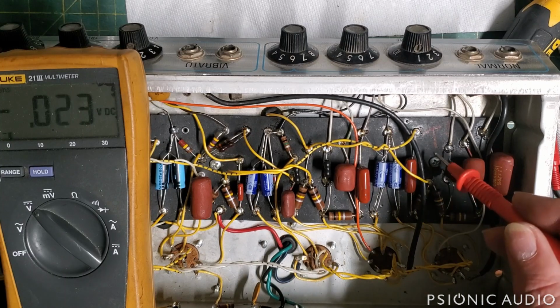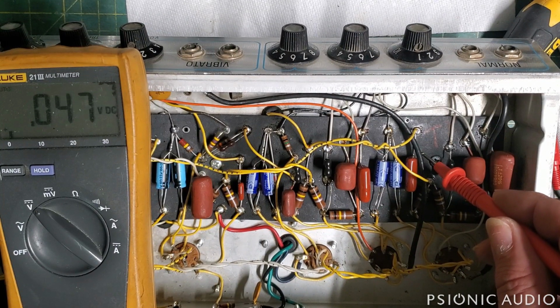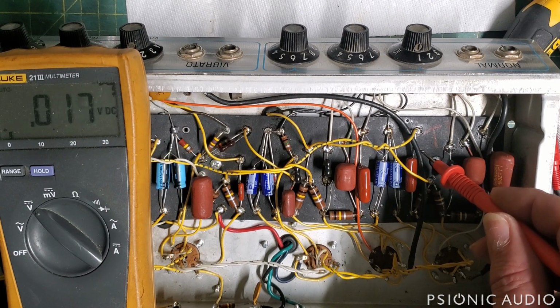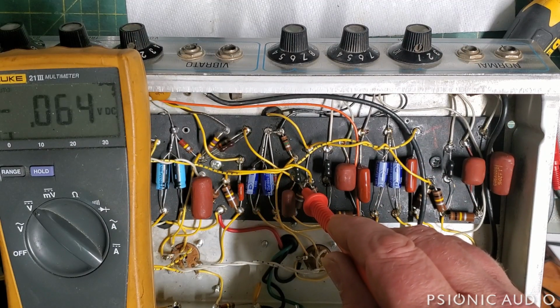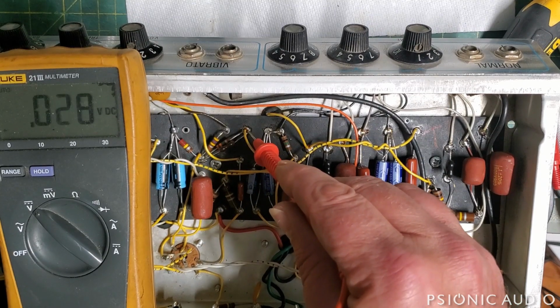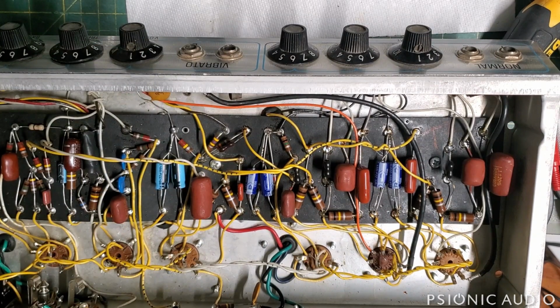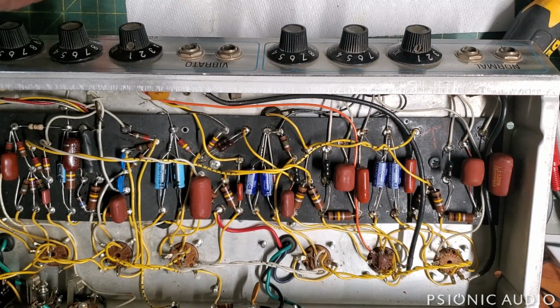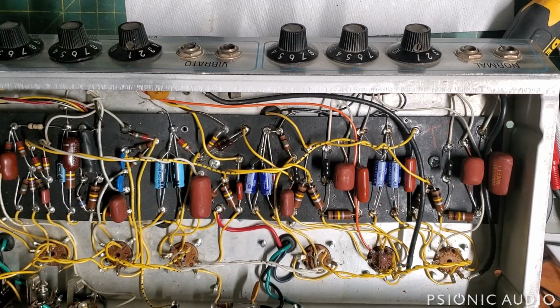Okay, after doing all that, the half volt I had here is now down to almost nothing. I can get that better, but that's fine. That's not close to anything really. This node here that was so bad had 200 millivolts. Almost nothing. So, more importantly, a big rushing water noise that was there is no longer there. So before I deal with the speaker and that reverb cable, let's hear this thing.